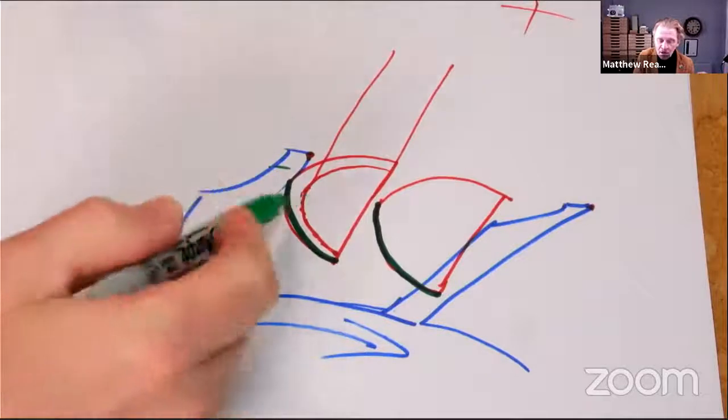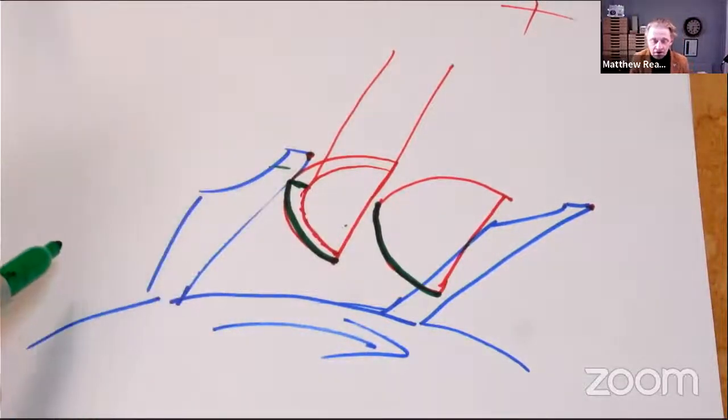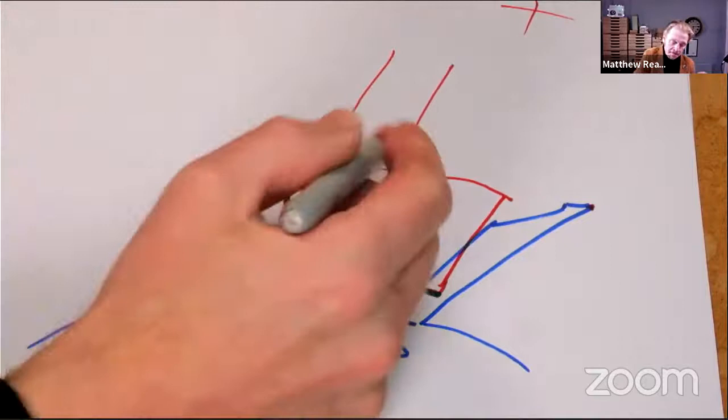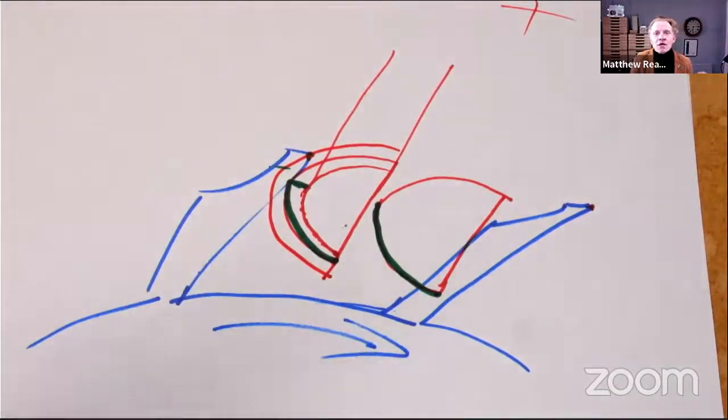But the problem is you're going to have a lot more drop because you've got this extra material here. So there's going to be more drop. More drop equals loss of energy and less impulse, so the clock won't run as well, all things being equal. And if you go with a pallet that's bigger in diameter, like this, then that's all well and good, but you don't have any drop, and therefore the escapement won't work at all. It'll just jam.